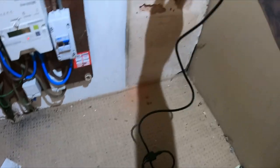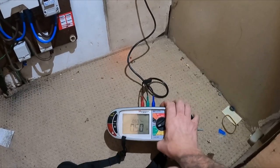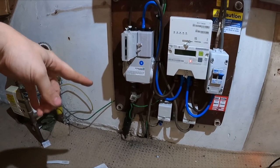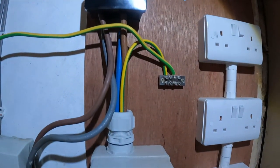We've got a ZS reading of 0.5 ohms on here. By doing that we confirm there is an earthing conductor present and our earthing arrangement is okay. We've got a TNS system here, which means the earth is on the outer sheath of the incoming cable. I've seen this quite a lot — an old earth tag put across there — and even though the DNO came out recently and upgraded the cut-out, meter and isolator, they've left that instead of doing a proper joint with a terminal block and a permanent lead. Let me know how often you come across this and what you do about it.